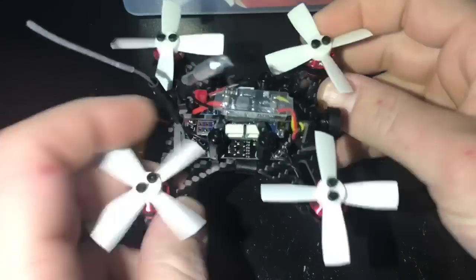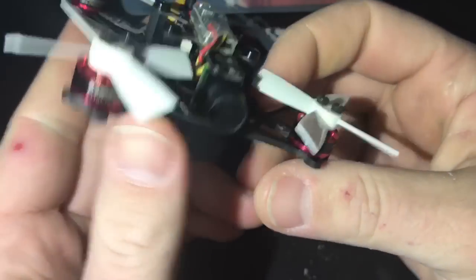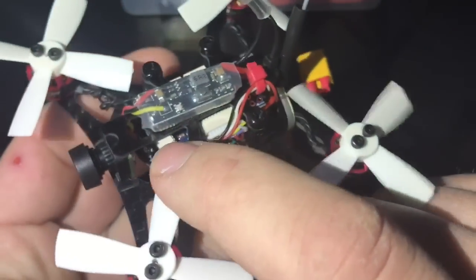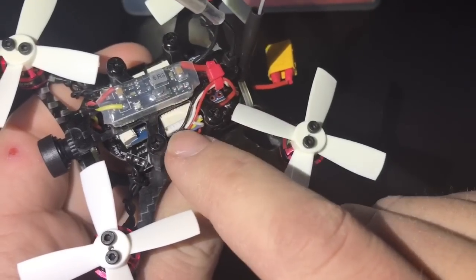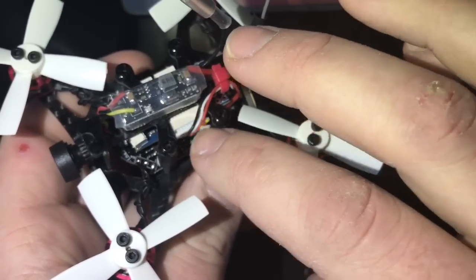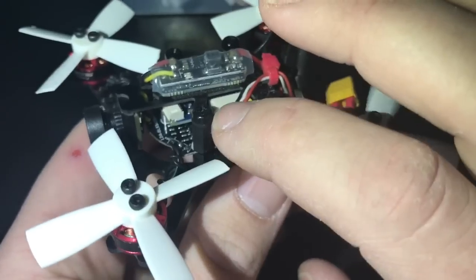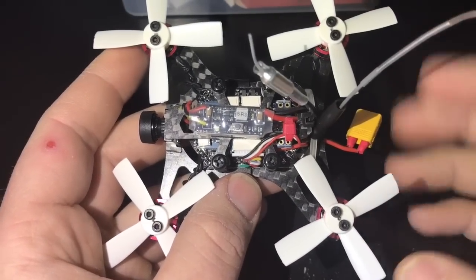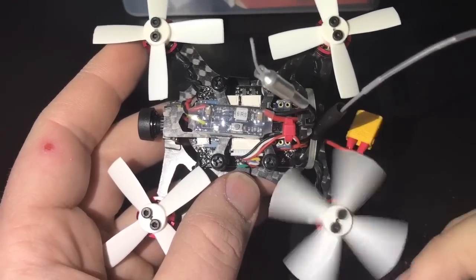It has an F3 racing flight controller at the bottom in a mill stack. There are ports on both sides — this board right here in the middle. When it came, it had wires off the front piece for SBUS, and the connector in the box can be used for PPM or PWM. I'm using PPM, so I'm using positive, negative, and signal. The flight controller is configurable with Betaflight right out of the box — it connected fine and I was able to change my auxiliary channels to arm with a switch and change flight modes.